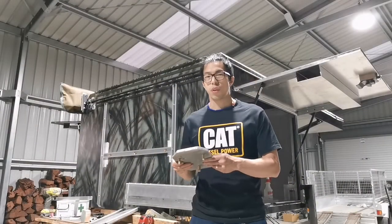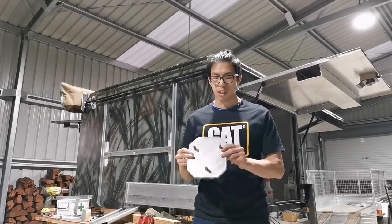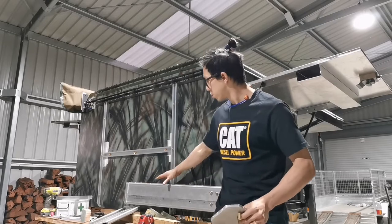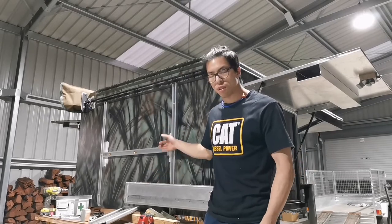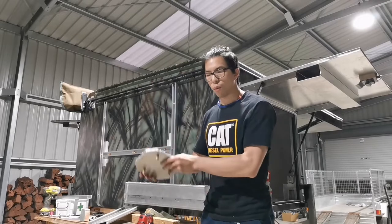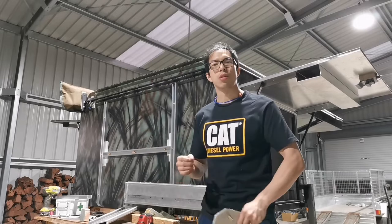You can see the wheel carrying plate is done. It's got three studs on it. Standard studs 14mm, it fits perfectly. So now the next step really is to work out the post. Where to put a post on this swing arm, and on the post, I have to find out the offset of the plate and the post and work out the angle so the wheel sort of leans onto the canopy a little bit. So it's not as far out at the back.